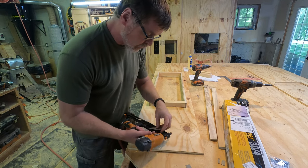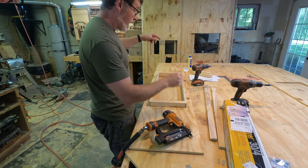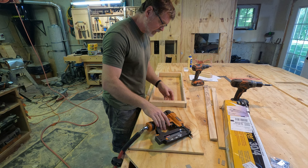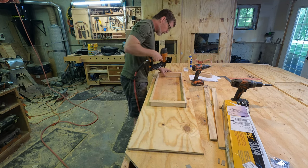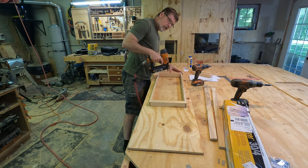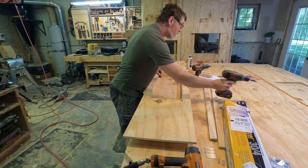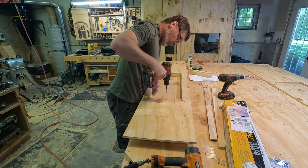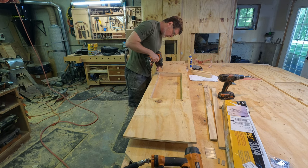The window trim on the corners is a simple little frame that fits between those angled corner posts. Everything will get fastened together when we put it up. These small pads are just to hold things in place temporarily with a little glue, since they're fairly lightly built panels, and then some screws through the sheathing into the two-by-fours, just like we did on all the other panels.